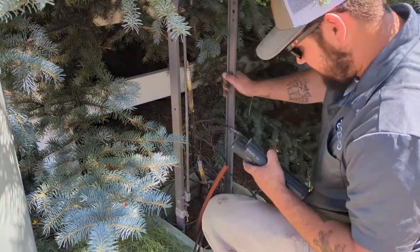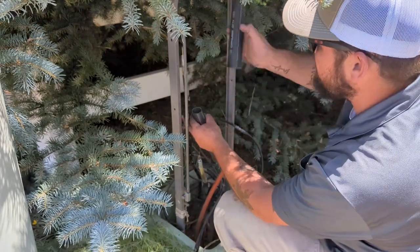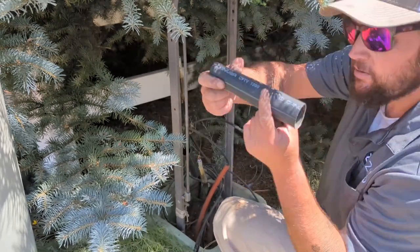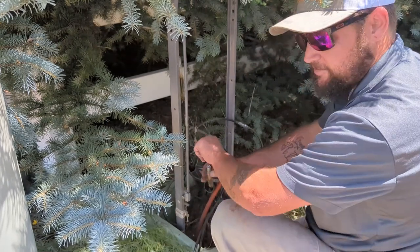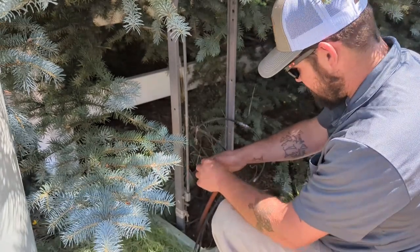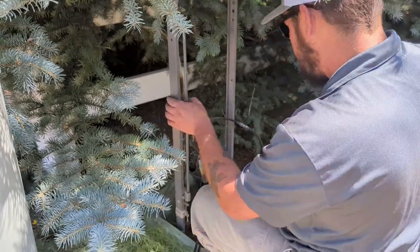Okay, we're back. Those are our 500s — our input and our output. This is the shrink tubing before it's shrunk — this is the 1300 size. I like to use this on 500 cable, it just shrinks a lot tighter. A lot of guys will just stick with 1500, but I like to keep all different sizes — 11, 13, 15, and 17 of this canned stuff.